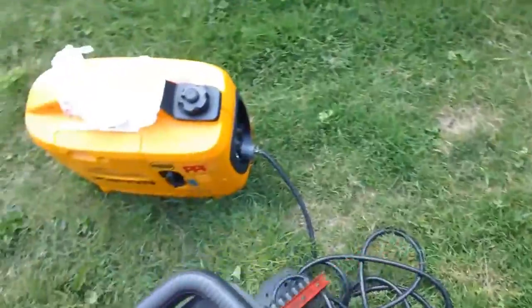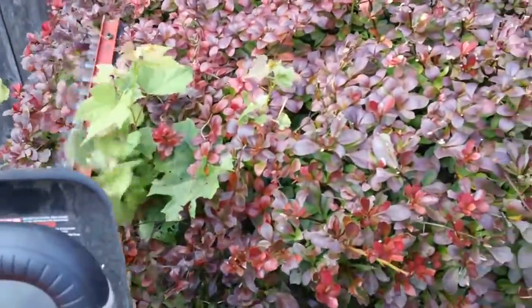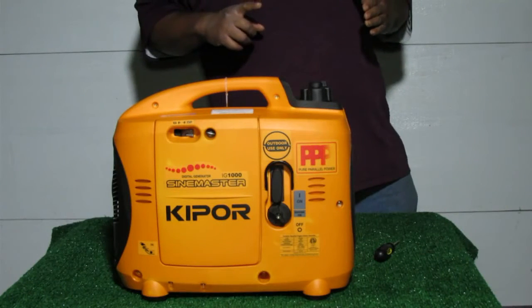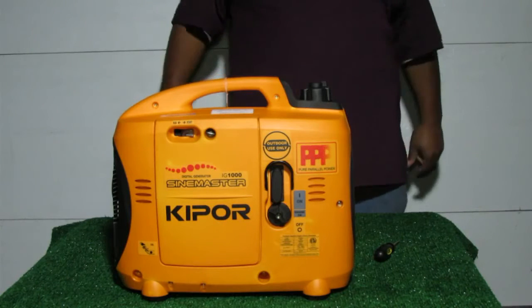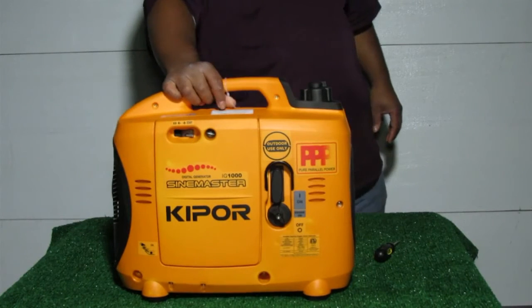As far as loads, I've been able to test it with various loads from 38 watts all the way up to near 800 watts, and the unit has handled them all with ease. It hasn't overloaded on me, and it's given me the rated capacity the manufacturer claims — unlike some cheaper quality generators that give you around 100 or so watts less than rated, which is another reason people typically choose Honda and Yamaha. But that's just not the case with this unit.